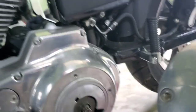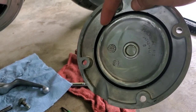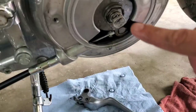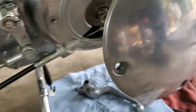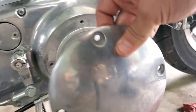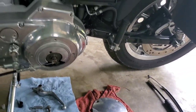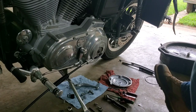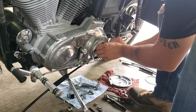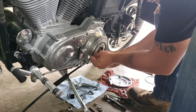From there, you're going to put your derby cover on. I have a new O-ring — I'm going to replace mine. If your old one is still good, you can reuse it. I'm only replacing mine because it's never been replaced. Notice where your spring is going to sit to hold the keeper in place. Make sure your spring is seated down in that groove when you go to put the derby cover back on. Stick your O-ring into the groove on the cover.